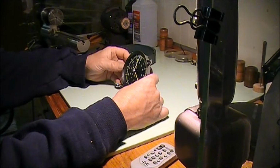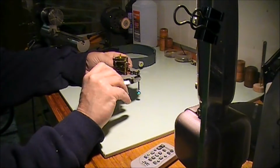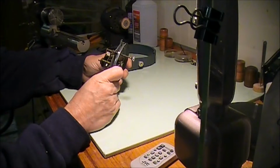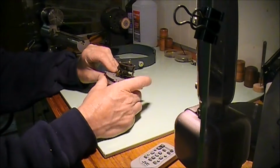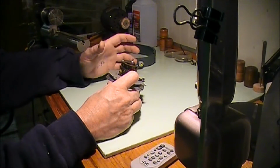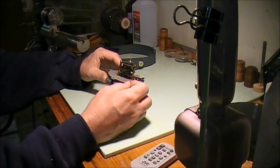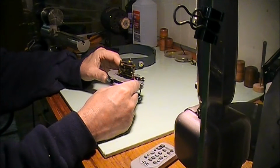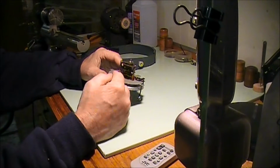This clock goes in the dash of the Corvette, and it's an electromechanical clock. It has a spring and a mechanical device that will wind it up. It will make the clock run, but electrically it rewinds itself every so many seconds. I think it pretty much equates out to about 1 minute. So every 60 seconds it resets and times down against a spring.